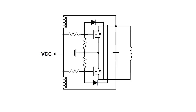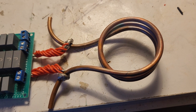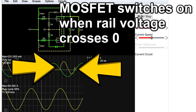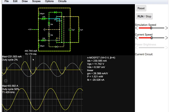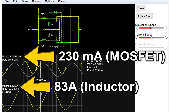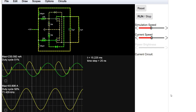Let's look at the electrical engineering side of things. A ZVS driver basically self-oscillates at the resonant frequency of the circuit's capacitor and inductor — in this case the inductor is the induction coil heating the pipe. The MOSFETs switch at the zero crossing voltage across the inductor, which is why it's called zero voltage switching. This soft switching allows the inductor and capacitor to have enormous peak currents while the MOSFETs see a relatively small load.